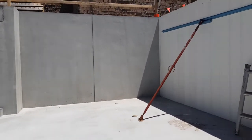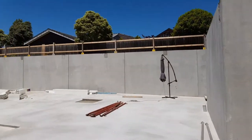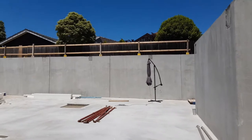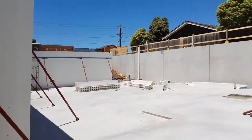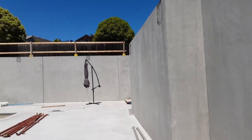As we walk along, I'll show you the junction between the traditional shotcrete wall and the Dincel wall, which is basically a weak spot from a waterproofing perspective. This junction here has got a fair bit of detailing behind it with waterproofing compounds to stop any seepage getting in. You may ask why this building is half Dincel and half shotcrete — the simple answer is that the shotcrete section is very close to the boundary, so it needs the bored piers to go in first to protect the neighbors. The Dincel wall is actually in the backyard of the house, so there's no undercutting of any adjoining property.